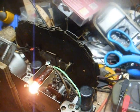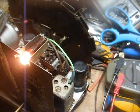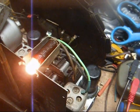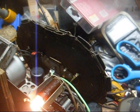Okay, we're back together and playing, but here's an example of why we always wait until the very last to do an alignment. Me taking this tuner out, cleaning it up, and possibly moving some wires around under the chassis as I was taking everything apart and putting it back together, threw our oscillator out of alignment enough so where 1010 is now coming in up at about 1100, where it was coming in closer to 1010 before.